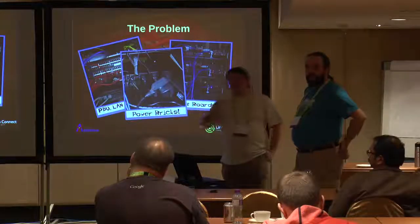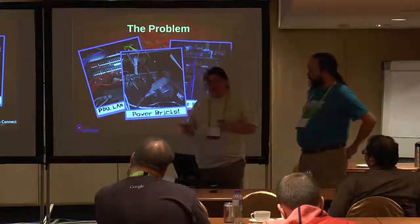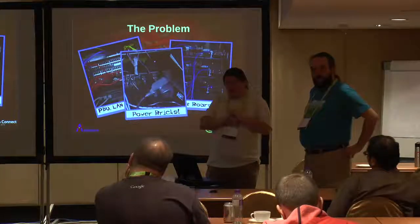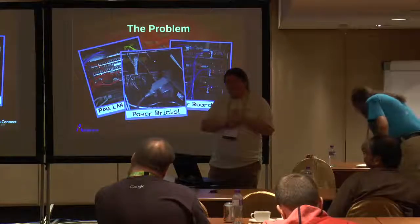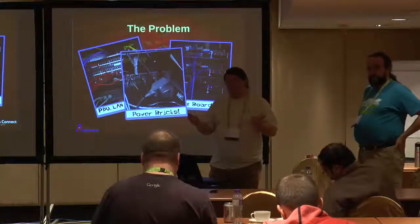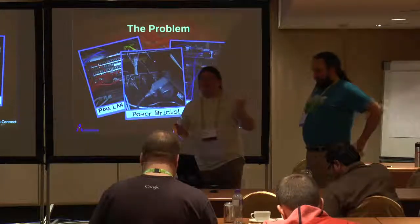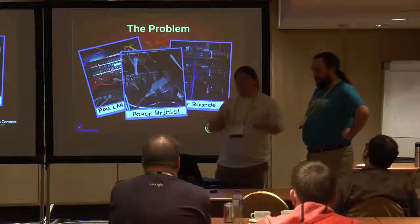Okay. And do you have GPIO support per EUT on this board? GPIO is uncommitted, so there are 8 channels. It's pull down only, so it's not air gap isolation, it's common ground. It's 12-volt tolerant, but it's not power out. So if you've got units which require 3 GPIO lines, you've got 6 to play with, because you can run 2 EUTs without having to expand it at the moment. If you only need the 1, fine. If you don't need any, that's also fine.